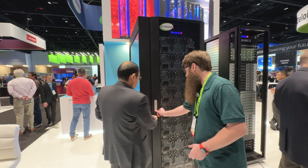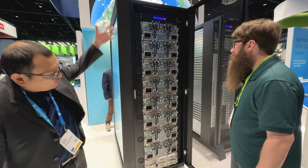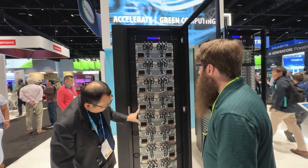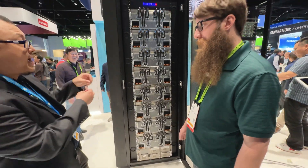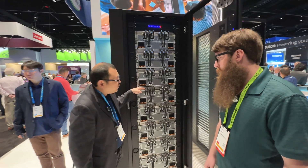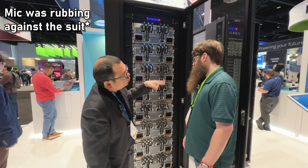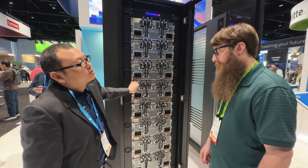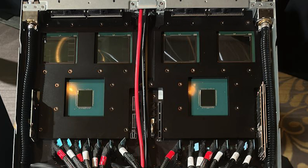Can I open it? Yeah, you can. So this is the liquid-cooled rack, completely liquid-cooled. We have eight systems in the rack. Down there is the cooling distribution unit, basically circulating the liquid. The red one is basically the outflow of the liquid — that's the hot one. The blue one is the cool liquid going in. This tray has the GPUs in it. This is HGX H100 or H200, and soon we're going to be supporting B200 as well.